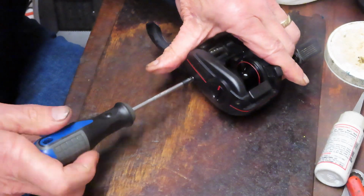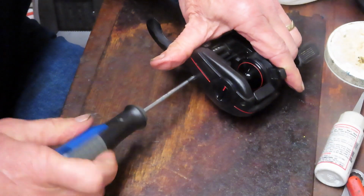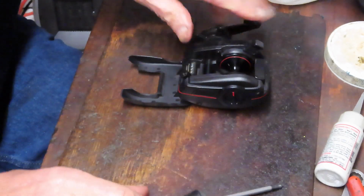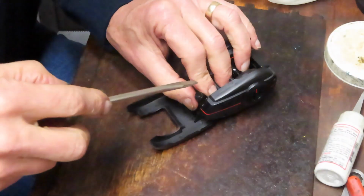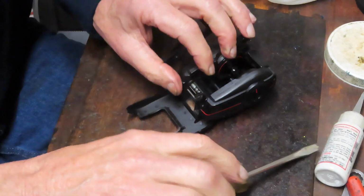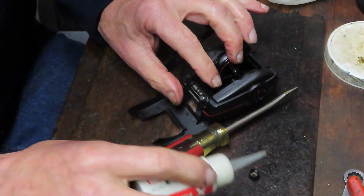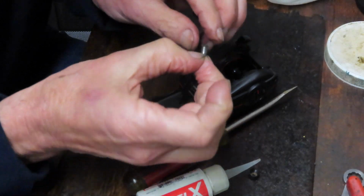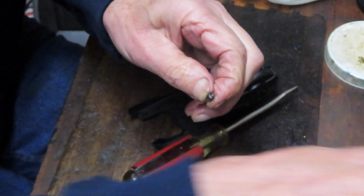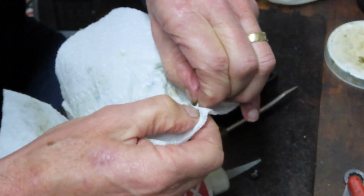It's been a learning experience, for sure. And one more piece is just to pull the cap off of the worm drive here. Pull the pawl. Check the pawl to make sure that it's clean. In this case, it needs a cleaning, so make sure that the two grooves on the pawl are free of the grease.